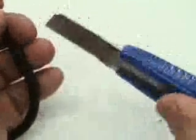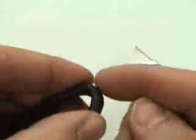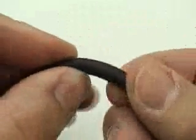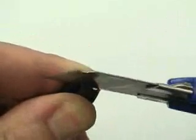Now to open it up, I'm going to use one of these box cutters — it's a new blade. I like working with sharp blades; they're actually safer. What I'm going to do is take the wire and fold it over, making the outer shielding stretch on the outside, then simply take the blade and gently apply a little pressure and slice. It literally wants to split open because of the stretching action from the folding. I do the same thing again on each side, and pop — there it goes. I just pull it off and twist this together into one contact.